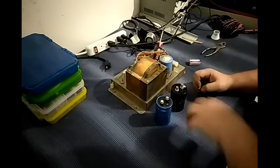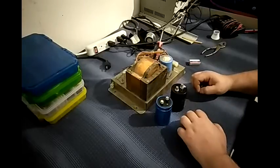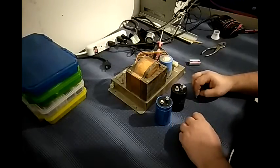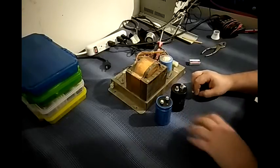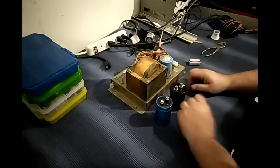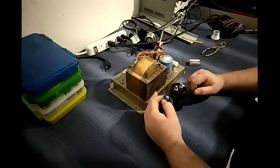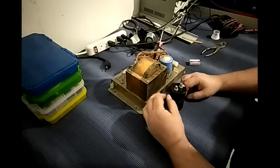In my opinion, you should replace any BigBlue on any Atari. I know there are people out there that are cheap — I'm included sometimes — who don't want to spend $10 and wait for it and tear everything apart. But I really suggest you replace BigBlue on everything. If your Atari game is having random resets, or the board might work in another machine but won't work in your machine, just think about that.